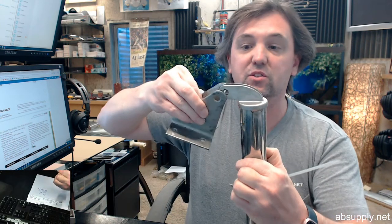Overall length just for archiving the data is about 13 and 5 sixteenths. Overall diameter of the top tube appears to be about an inch and a half, and then the lower tube is about an inch and 3 eighths. That boot that's down there is about an inch and 3 quarters by inch and a half, and this video is certainly meant to serve as dimensional evidence of the item.